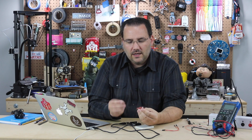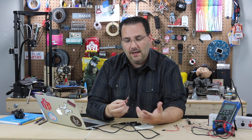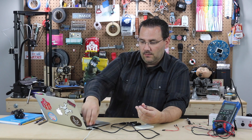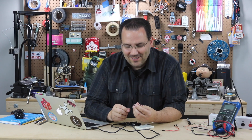I will warn you, before you try something like this, think about electricity and how it flows. I'm going to be trying this with my computer. Do I really want my laptop plugged into mains power and have my arm connected electrically to the Arduino? Probably not a good idea — certainly not for anything commercial or for anyone else to try. For testing purposes, I don't see a huge problem, so I'm going to unplug my laptop. And once my laptop's unplugged, I feel a lot safer using this for prototyping.